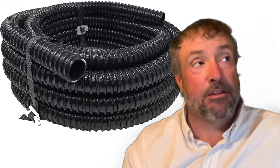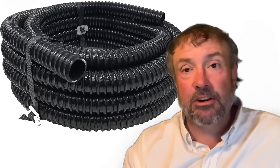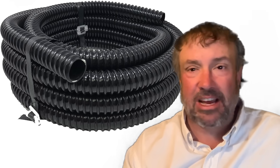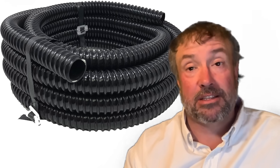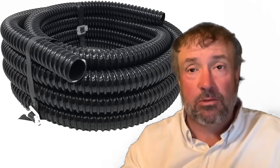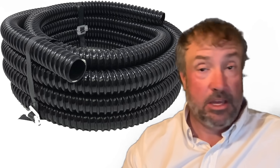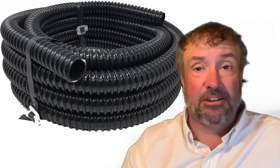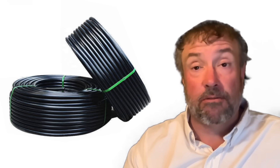This is not one of those geo-air systems with tubes in the ground pushing air through them. The problem with pushing air through tubes in the ground is you're going to pick up bacteria, mold, and all kinds of weird things. They can plug up sometimes because they're four to six inches wide — if the ground shifts just a tiny bit, they'll fill with water, and then you can't get air through. This system avoids all that.